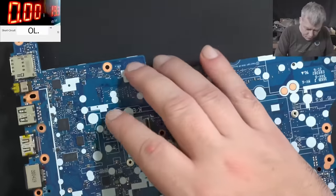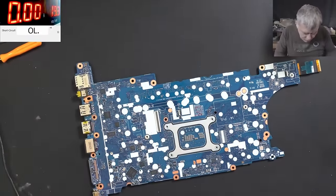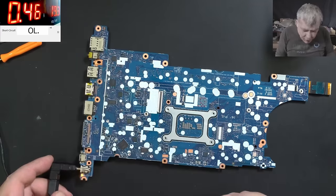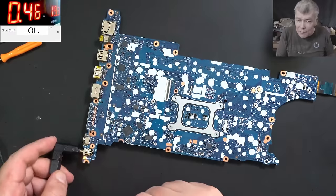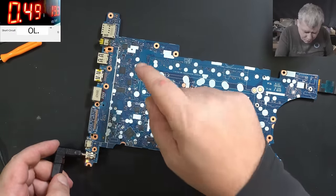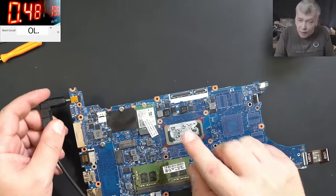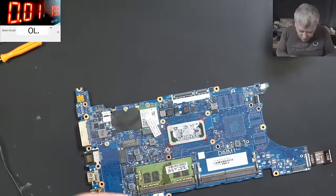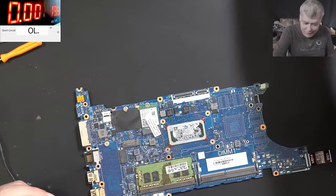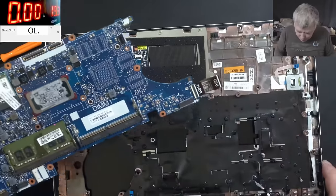Good, let's plug the charger. The motherboard started at 460 milliamps - we have an orange light. The EC chip could still be good. 500 milliamps - obviously the CPU is probably getting hot, and it is fixing the laptop just by cleaning. Wow, this is new!